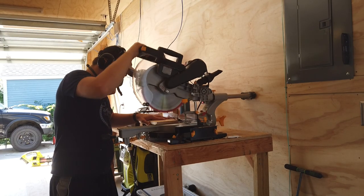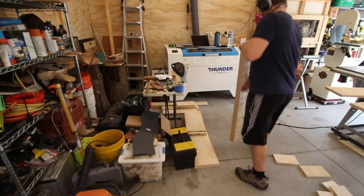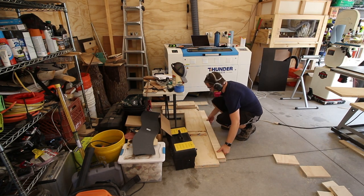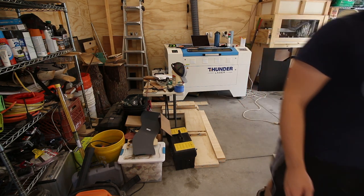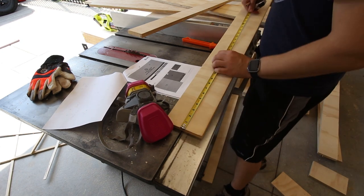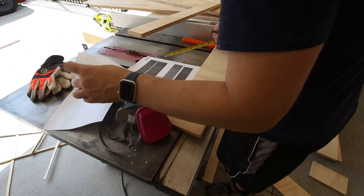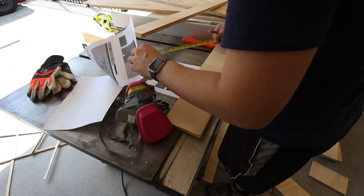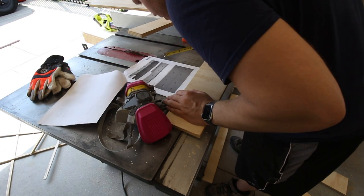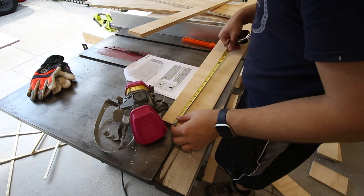It was really nice being able to finish a cut, double check it for length, and then mark it with the code I established on the cut list. Days later, when I would eventually work with the boards that were cut days prior, I didn't have to re-measure or scour the plans to figure out which board or what part of the project it was for. To make sure I was making the most of my scrap, I would take a board that was wide enough for the cut and figure out which cuts could fit on it to result in the least waste. That sometimes meant combining boards from across the plan document, provided they had a common width, but the end result was two full sheets of the ¾ inch plywood left over, so the extra time and planning definitely paid off.